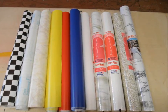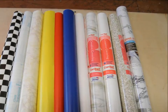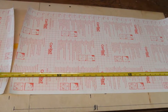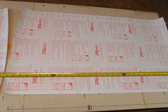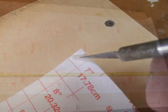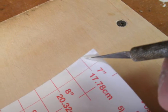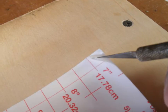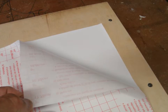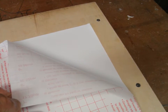The contact paper will come in 18 to 20 inch widths and various colors. To start with I cut two pieces 31 inches of the 18-inch wide contact paper. With the 31-inch piece I'm going to start removing the paper backing using an X-Acto blade, then I'm going to peel it. This actually peels pretty easily once you get it started. You'll need to hold down the paper and peel the back off much like you see here.